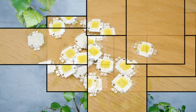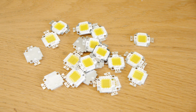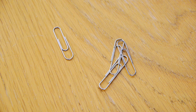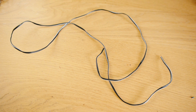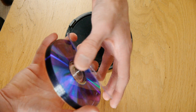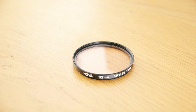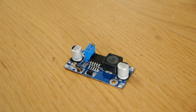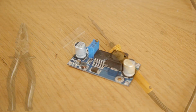To build one, you'll need 20 10-watt 32-volt LEDs. These are pretty inexpensive, and you can find a link to them in the description. You'll also need some paper clips, a set of pin connectors, some twin-stranded wire, a battery holder, a clear CD from the bottom of a stack of discs, or alternatively any old CD if you wish, and an old lens filter that's the right thread for your camera's lens. Additionally, you'll also need a voltage booster, a link to which is in the description.